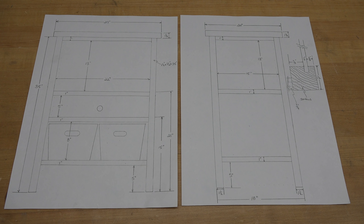Let's talk about the materials we're going to use. I'm going to start off by making the legs, which will be an inch and a half by an inch and a half by 35 inches long. This entire project — as much as it's one of my pet peeves — the wood will be painted. For that reason I'm going to be using poplar for the legs; it will accept the paint well.